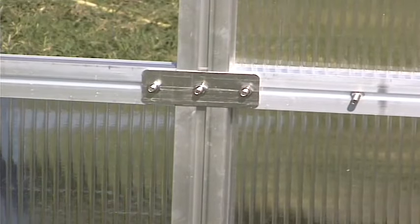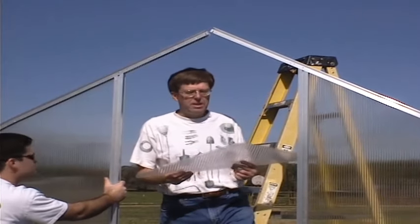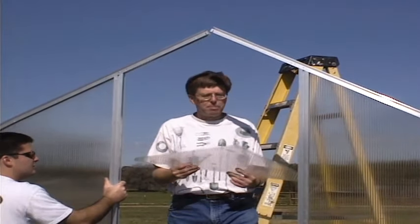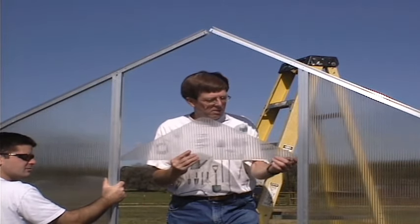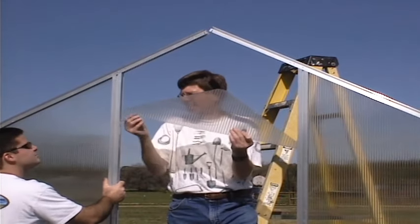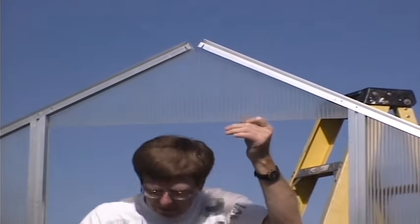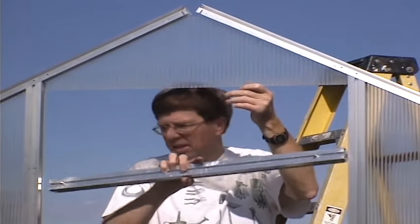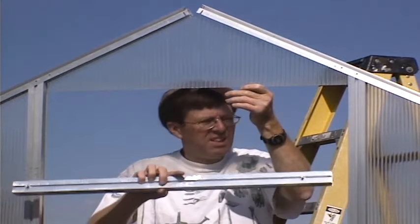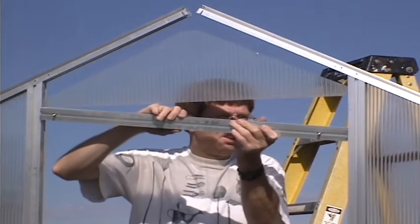That's it. You have done most of the back wall. Next, what we do is we insert the triangular piece that needs to go above the rear wall window. I'll line that up in here. Then get my bar. That I need two. The crossbar that goes underneath, it needs to have two bolts in it so that you can attach it correctly. That's what we're gonna do.